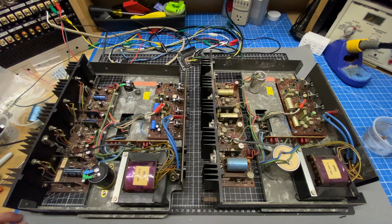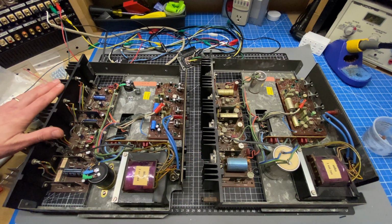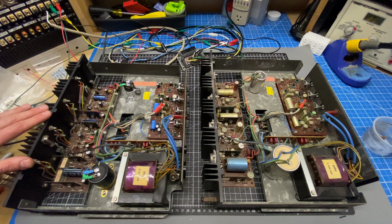One of the challenges with this project is that the only available PDF manual is in German, so I had to do a bunch of Google translation to understand the calibration procedure, which we'll go over in detail, at least how I understand it, when this chassis is done. But this one all tested out pretty well. There might be some ways to optimize this. I might need to change out some resistor values just to get them more accurate so that the channels balance to one another.